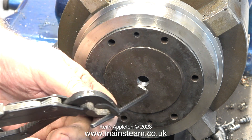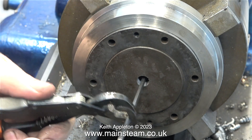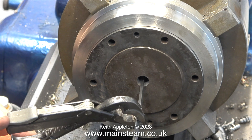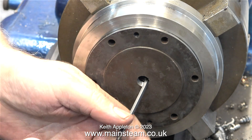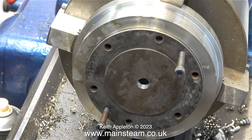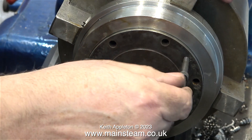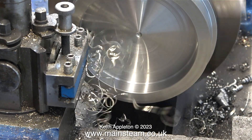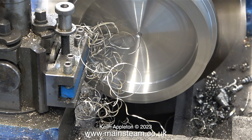The piece I'd been machining was quite hot, and the cylinder cover was very cold. I thought I could use an Allen key in the hole and just persuade it to come out — but no, it was in there solid. Thankfully, this particular cylinder cover has two threaded holes at each side to allow you to withdraw the cylinder cover from the cylinder. By inserting a couple of quarter BSF Allen bolts and screwing them in towards the stainless steel cover, the original cylinder cover soon came loose.